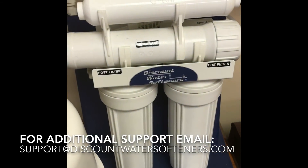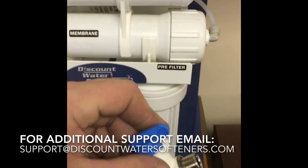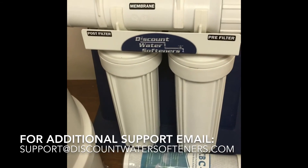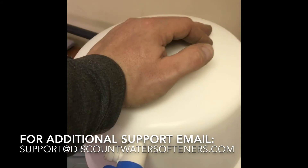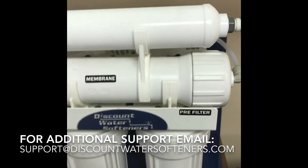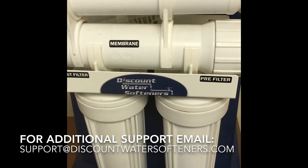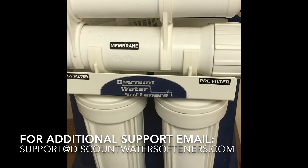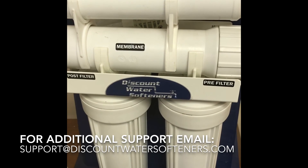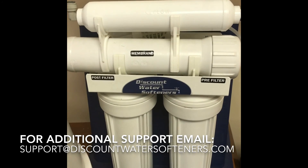Always make sure that after you change filters you turn your tank back on and your supply water — whether you use the angle shutoff or a self-piercing saddle valve. You always want to refill your tank at least once to get all the carbon fines out and any preservatives that are on the reverse osmosis membrane so you're not ingesting them. Run through one whole tank full of water, then another whole tank full — just run your faucet until it goes empty — and then you can drink the water after the second tank has gone down the drain.